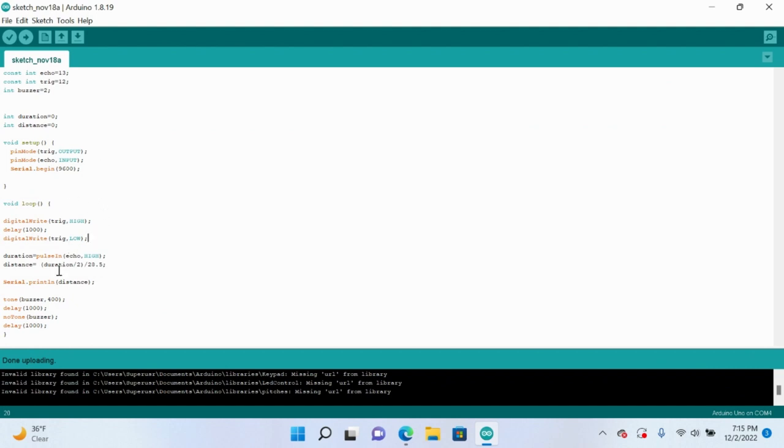So this is kind of what it looks like — I'll link it in the description. After we use if statements to determine — kind of similar to the LED lights, but instead of the red LED shining, we're going to sound the buzzer. It's very familiar to the last video where we were talking about the motion sensor, but in this one we're using input and information from the buzzer in order to develop a different output. I urge you to do it yourself. Using if statements, if you see distance — kind of similar to the LED video — we can just say if distance is less than some value, then tone buzzer 400. You can just do it that way, or some other algorithm that you choose, but I'm going to leave you off here and we're going to come back when you've got the answer.